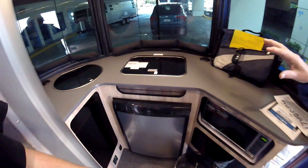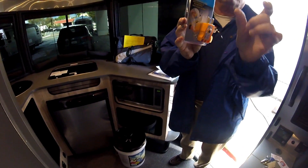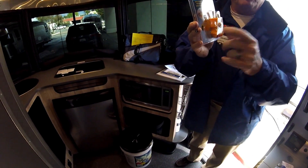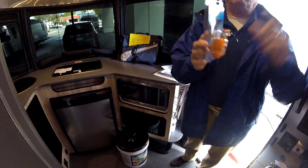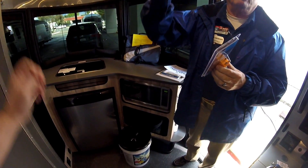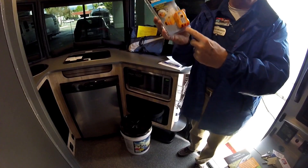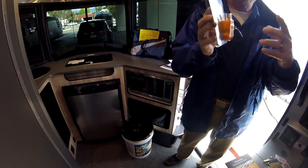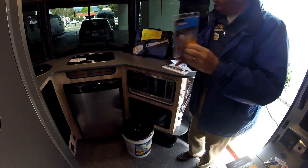I've replaced the voltage monitor with another unit that gives me a voltage readout. It does the same job but also tells me exactly how many volts, because you don't want to run the fridge when the voltage gets below 105. In the low 100s you're risking burning out the compressor. Even though the indicator shows amber, there may not be enough voltage to keep the fridge happy.